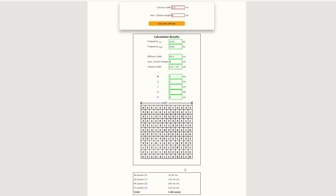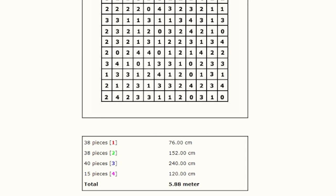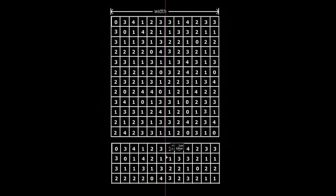To begin with, you'll need to plan out your build. I wanted to make my diffuser 18 by 24 inches to fit the best in my space. I bought the 2 by 4 foot backing and cut it down to 18 by 24, and then I needed to figure out how many 2x2s I'd need. There are some online calculators that let you input the width of your columns and set the max length you want to use — I used one of those. Keep in mind whatever wood you're buying might not actually be the exact size it's named; it's usually a little bit smaller. The calculator spits out a square grid of the layout it recommends for optimal diffusing and tells you how many of each size piece. You'll then need to add all of this up to get the total length of lumber to buy.